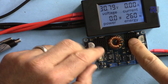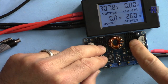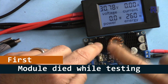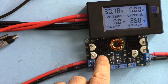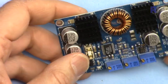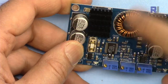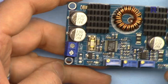It was running at 8 amperes when I went to 9 amperes — even with a very low current at the input, it just smoked. As you can see, this is dead. I was reading online and a lot of other people have complained about it. This module is failing because the design is bad or the components are bad. The actual chip is good — it is from Analog Devices, a very trusted manufacturer.